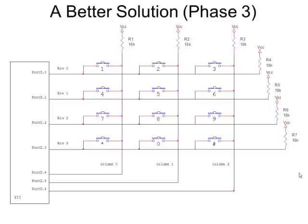There's a complication: if a one written to an output pin is a direct short to VCC, and you press two keys in the same row simultaneously, you might create a direct short from VCC to ground — and that's not good. It won't necessarily cause smoke, but it will damage the port bits.